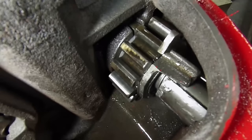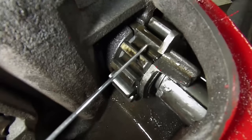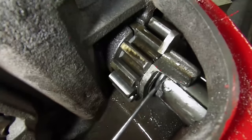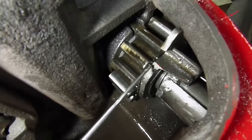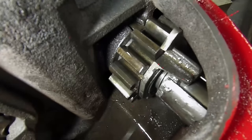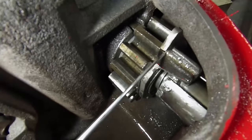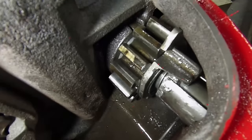Let me show you what's going on here with this part of the gearbox. This is one of the two gears we had in the lathe earlier. Here's the babbitt sleeve that came through the nose of the gearbox case. There's a spring right here that pushes from here to here. And this washer — it's called an oiler — the spring holds it tight to this gear, and the gear turns in this direction normally. So it comes down through the oil in the gearbox, the gears pick up oil as they come around, and this little hook shaves off just a little bit of oil. That oil drips on this, which is on a slight downhill slope, comes down, drips on the end, and runs onto the shaft. Now they've got a hole drilled in the bottom of this babbitt sleeve to allow the oil not to fill up and overflow, because when it would do that, it would run out the front of the gearbox and be all over the windmill itself.